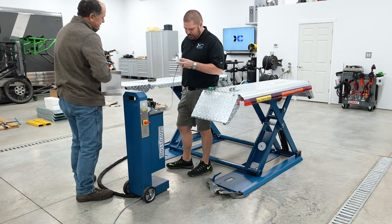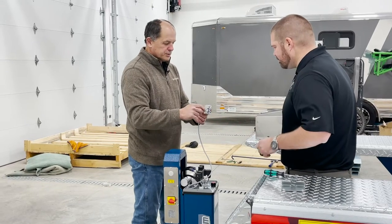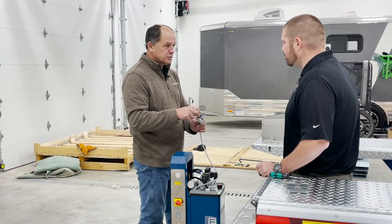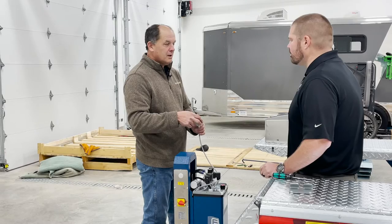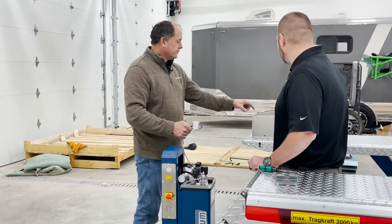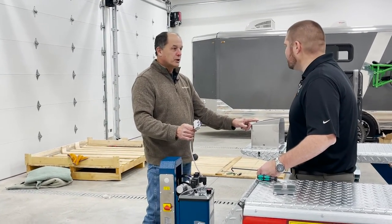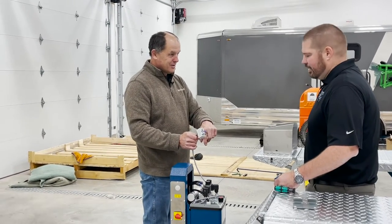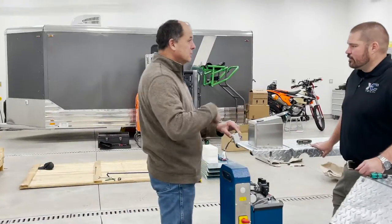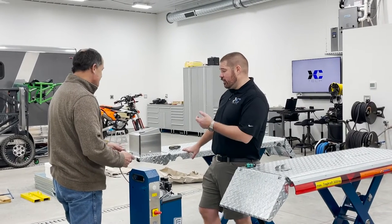And this is something else that even Nussbaum does, because it does have electric lowering, this whole double switch thing. You're going, okay, you're an electrician, right? You shouldn't have to have two switches for up and two switches for down. But what it is, there's a normally open, normally closed, normally open, normally closed. So what happens is the up button derives its power through a normally closed contact on the downside. So if you're going up and you push the down button, it cuts the power to the up button. It's a dead man. So you can't push both buttons at once. And you get a true dead man that way.